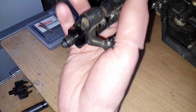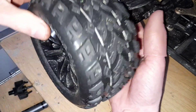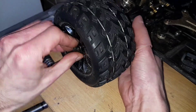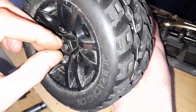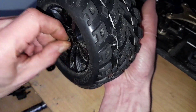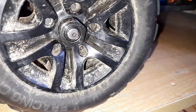What I've got here are 3mm by 7mm o-rings, and these washers are 3mm by 6mm. I put the washer on first, then the o-ring, just like that. I put my pin back in and as soon as I started screwing it in, it just pinched lovely — the o-ring takes up that little bit of slack. Not just that, you're also getting to use a bigger hex head: now you're using a 2mm hex head rather than a 1.5mm. And that there is how it looks with the o-ring just getting pinched just a tiny little bit, and that pin will not come out.